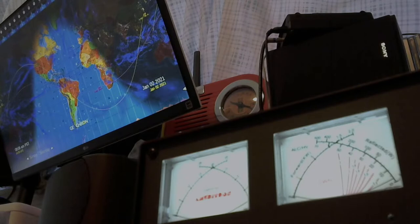It's a fascinating time because it allows you to, if you know how to work it, first, just look for the light. If you look for the light in the sky, that's the direction the signals should come from and will come from. Then, as it goes more north or more south, you'll start to hear signals go that way. And it's a pronounced improvement. You'll hear signals go up 2 or 3 S units quickly. And sometimes they'll be that way for maybe 5 to 10 minutes. It's a short period of time, but then it will drop back down.